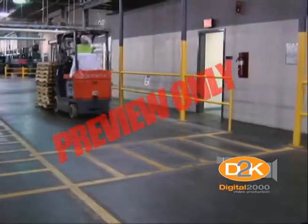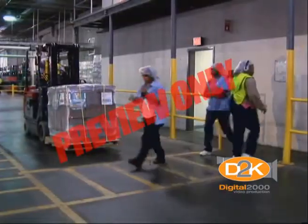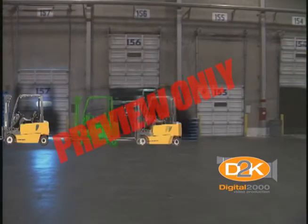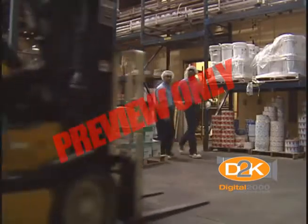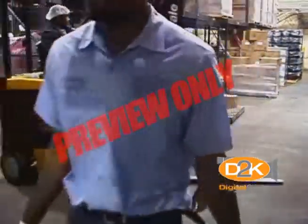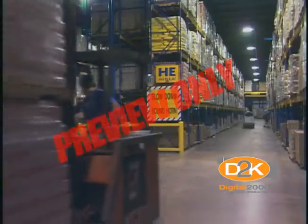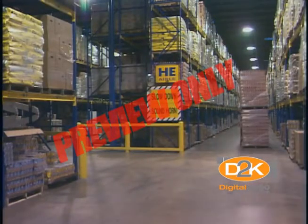Fire aisles, access to stairways, and fire equipment shall be kept clear. When traveling, all traffic regulations shall be observed, including authorized plant speed limits. A safe distance shall be maintained, approximately 3 truck lengths from the truck ahead, and the truck shall be kept under control at all times. The driver shall be required to slow down and sound the horn at cross aisles and other locations where vision is obstructed. Other trucks traveling in the same direction at intersections, blind spots, or other dangerous locations shall not be passed. If the load being carried obstructs forward view, the driver shall be required to travel with the load trailing.